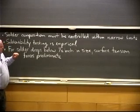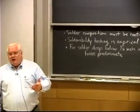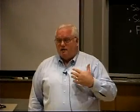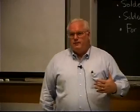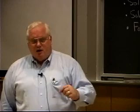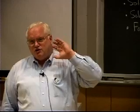For solder drops below 1/8 of an inch in size, surface tension forces predominate. Well, it's not just solder drops, it's metals in general. And you might think, well, that's kind of a silly rule of thumb, but I would say that, of course, I'm a metallurgist, but twice a year I come across some phenomena that someone's talking about that they don't understand exactly what's going on. For example, I was at a NASA workshop this summer, and they were talking about how they want to build the space station in space by doing electron beam melting. And people were proposing to do a study of the gravitational effects on the liquid metal.